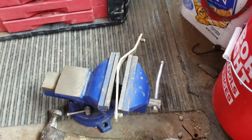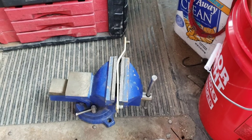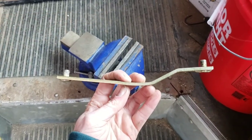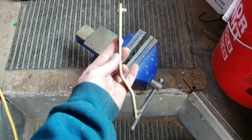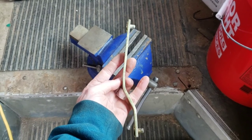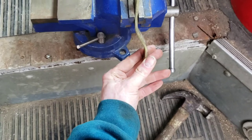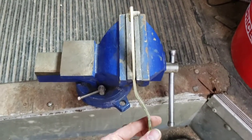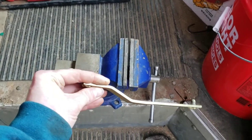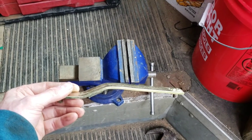I'm assuming that was a factory bend or close to it, and this is what got the extra bend to it. Alright, that's how far I'm going to go — I'm going to let off now and see what happens and try fitting it on the tractor. So I took it out and that's what I've got. I feel like I can put it in the vice and give it maybe a couple of whacks to get it just a little tad bit straighter. Yeah, I like that a lot better. I clamped it like that and was able to hit it at the bottom and top where I wanted to, and now that's looking like it's probably what it was shaped like from the factory, or pretty close to it. I never got video or looked at it that closely when I first bought it, so let's go test fit it.